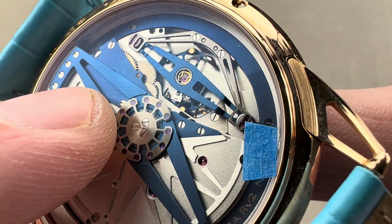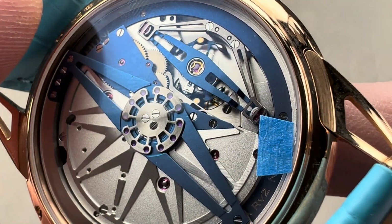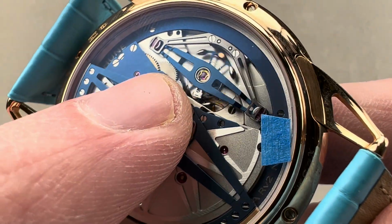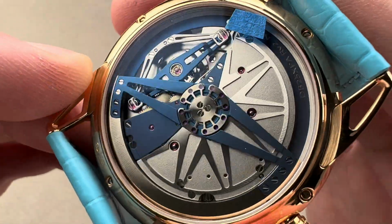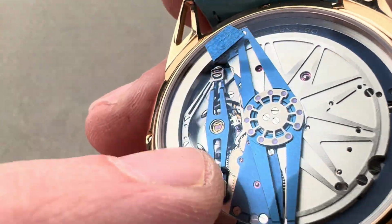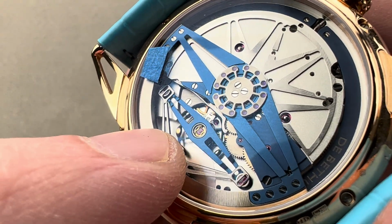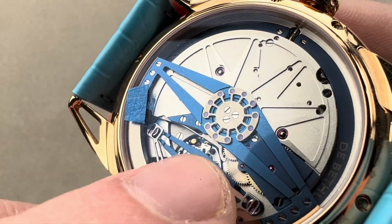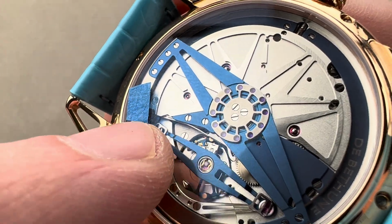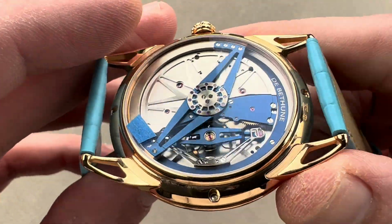You can sort of chart the changes over the years. Now we have a hairspring that's actually 2 elements mechanically clamped together and shaped by hand. The purpose of that is to create a shock-resistant and thin flat hairspring that nevertheless has the advantages of an overcoil in that it breathes concentrically in any position. It beats away at 4 hertz or 8 beats per second, 28,800 vibrations per hour. You can see satination on the wheels, satination on the spring assemblies, and then de Bethune's silicon escape wheel to reduce friction as well as maintenance requirements. In short, there is a lot going on.